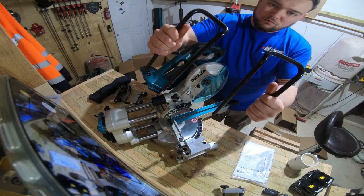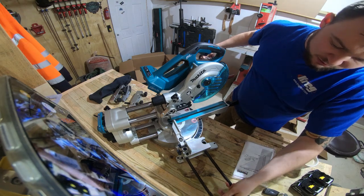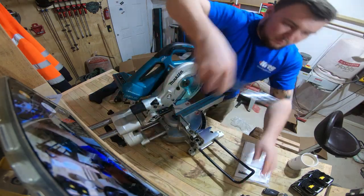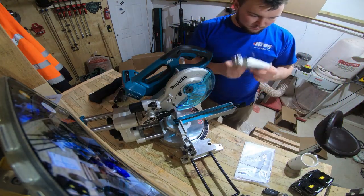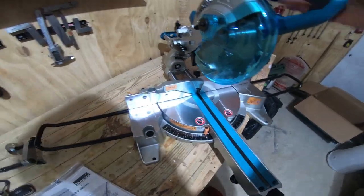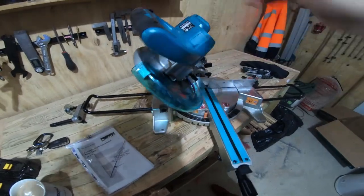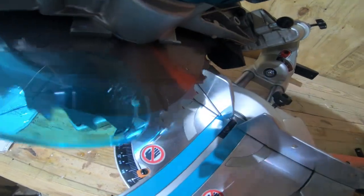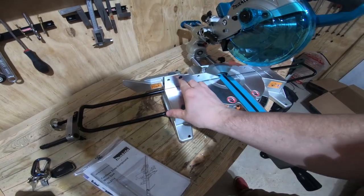These two rails here, and these just go on the side. These are the extra supports for your materials. What are these? See here, if I am doing a bevel cut, so release that lever on the back down to loosen, I can do my 45s with miters. This metal bit here will have to move, otherwise I'm going to cut straight into it, and I know I am. So that's going to come over there. I might even just take this off completely.